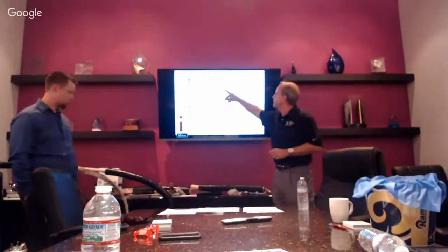All right, so this is kind of what we do when we're designing the system. Somebody says, I've got 12 beers. They send us a floor plan, we do some measurements. We've got to come up with some kind of routing, because normally there's not a conduit plan when we get the quote request. We get a rough idea what the line runs are, and we know how many flavors. If it's like a 10-line bundle, and I know it's going underground in a conduit and staying within the footprint of a building, I know that the ground's pretty cool. So I'll probably do my calcs at 95 degrees, because I never want to be undersized.